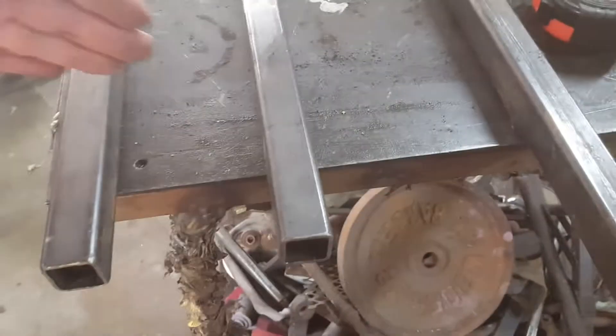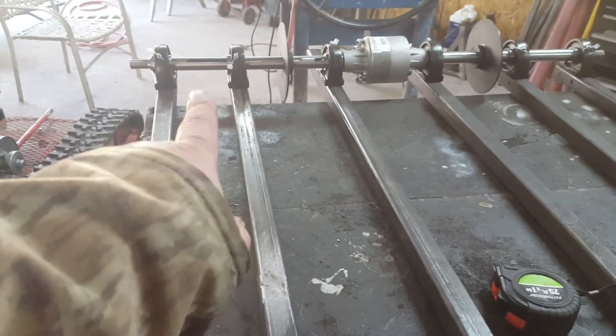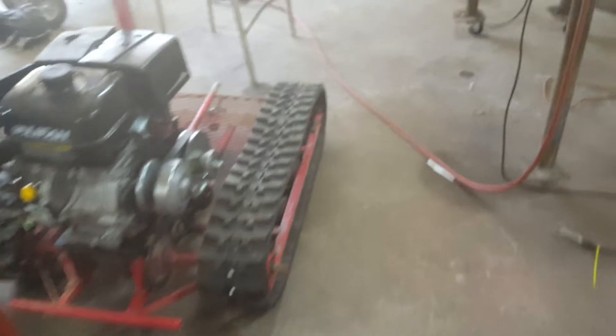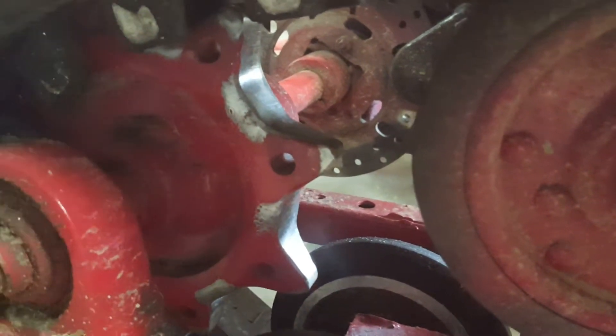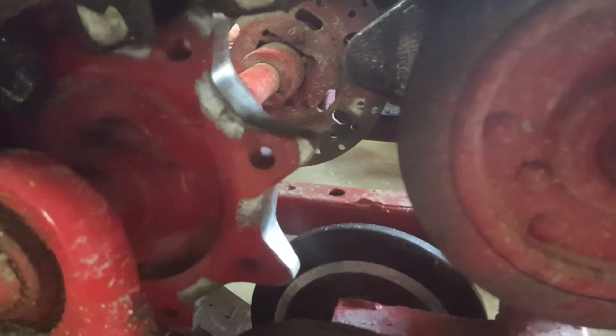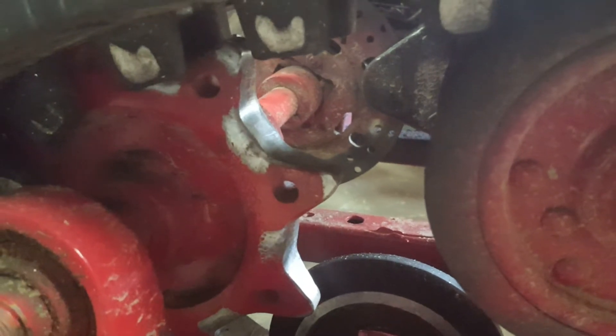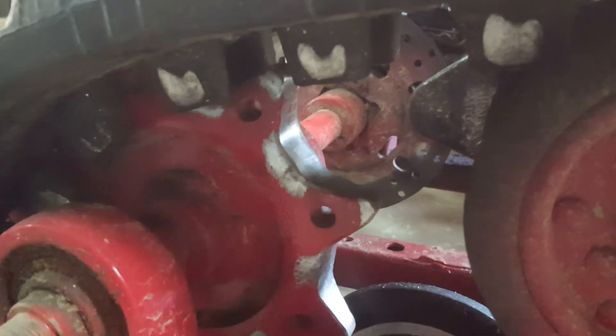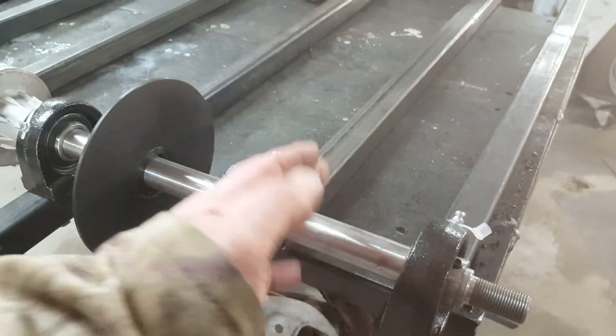Next video we'll build the braces and really talk about the sprockets, because that's an integral part. The sprockets were copied off a Honda powered wheelbarrow — I think it's an HP 250 or HP 400. I took it to a machine shop and they just copied it and cut it out of one-inch steel, cut the center out, and I made a hub to fit over the shaft coupler. You can buy two of those for the price of one Honda powered wheelbarrow sprocket — which is cast — plus you still have to build a hub for it. Solid steel, a little wider at the top since the Honda ones are tapered. I really like them.